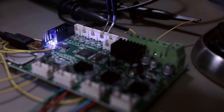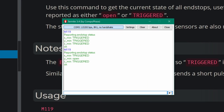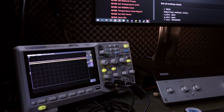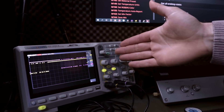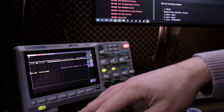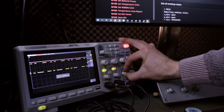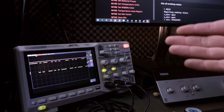Then we can see the states from the end switches. If I use a pair of pliers and short the Y stop, you can see that it's open, and there's some wiggling. If I send a command, and we use a trigger set to single, then we can see the ones and zeros appearing on the screen. The yellow line is the communication from this computer to this board, and the purple line is its reply. So you can see the command and its reply — ones and zeros. In order to know what we are actually sending, we have to know the protocol on which this works.